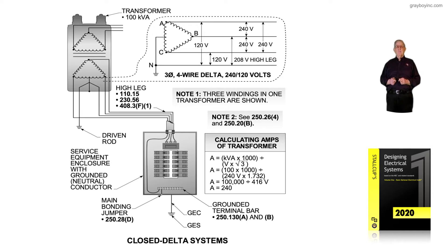Notice in the illustration showing the windings right above the illustration, we have a high leg involved. When you start measuring as an electrician or designer how many ungrounded hot conductors you could connect to ground that would be usable for 120 volts, in a delta system there are only 2. Reviewing A to the neutral connection to ground gives 120 volts.